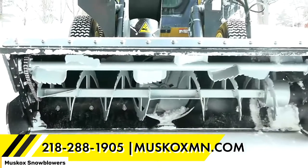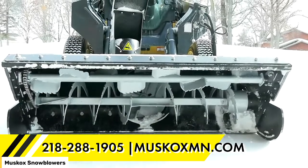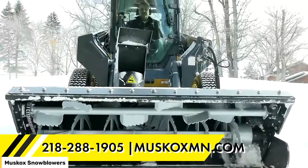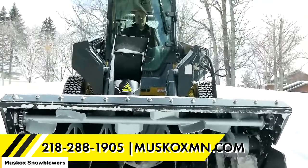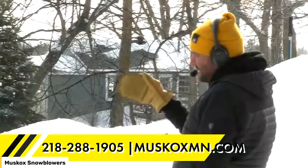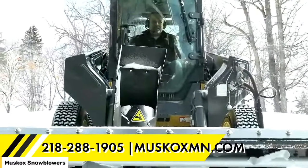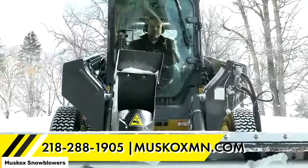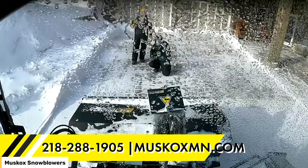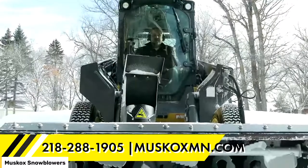What I wanted to point out here real quick, John, with Peter's camera, is we have a lowered chute. Our chute is lowered on purpose. What we have found is that increases the visibility of the operator. As you can see, that chute in its highest position, as Ron's trying to blow some snow on us, make sure we're paying attention, it's at his knees or lower. So he's got great visibility. He's not needing to look around the chute. That's one reason. It's safety, and you're more efficient. You can move faster. You don't have that obstruction in front of you.